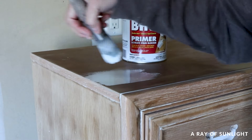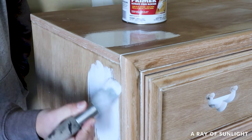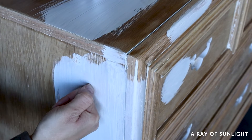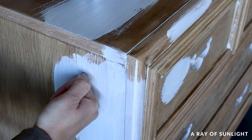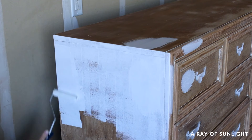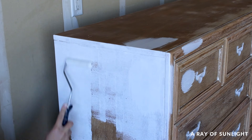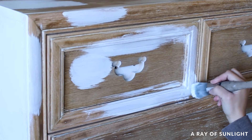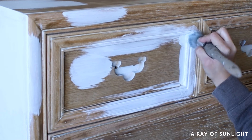This time I brushed it on a couple of test spots and let it dry for an hour or so, and after that it did not scratch at all. So we brushed and rolled it on with a mohair roller and a round zebra paintbrush. Both of these primers work well with oil-based paint and water-based paints, by the way.